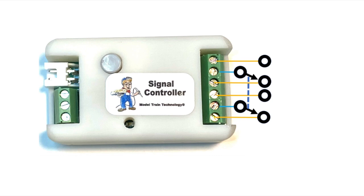Here's the signal controller — the DCC relay inside. It has a double pole double throw switch and here are the outputs. They're electrically isolated but mechanically connected. You can just follow this diagram as you're wiring up your layout. The hole in the middle and the bottom is the blue LED indicator — we use that to let you know what's going on. There's also a push button that allows you to set the controller address: any valid DCC switch address from 1 to 2044.